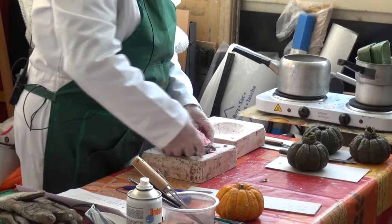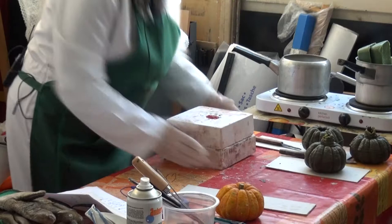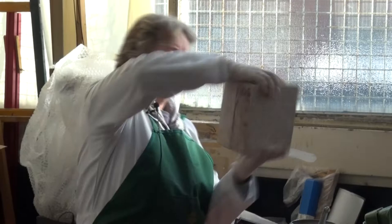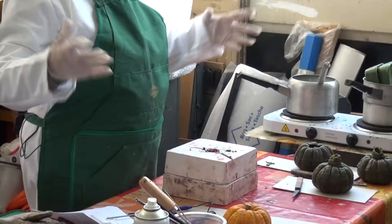What's likely to happen is the top part will be a bit thinner, so that's where you might need an extra layer. I'm going to put some more in and show you how you can create another layer — but if your wax is too hot it will melt what's already in there, so you might want to let it cool down a little before pouring. I'm going to rotate it so I can get more wax on the upper section — you can do this more than once. Ballpark figure: three to five millimetres, and if you're building something bigger you obviously want more layers.